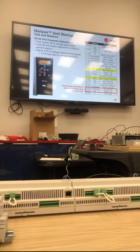And then the TR150, these are the parameters themselves that we change. The big thing we want to let you guys know of, the two in red, there's probably 300 units in the field with the wrong parameters set. I was going to ask that. Yeah, because I've had a ton of those where you go to the site and every time the customer powers the unit on and off, the drives will not reset. Correct. And I've had to go in and change that parameter 1420. Some of them I found are set on 5 trips. Yeah. Most of them are 3 or 5.